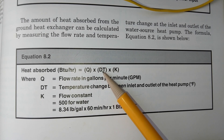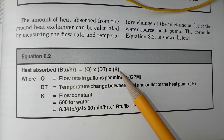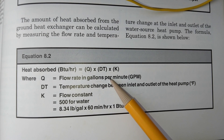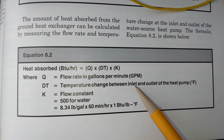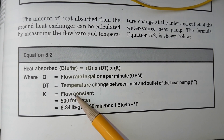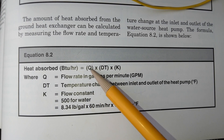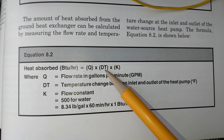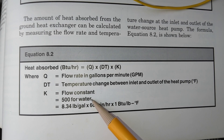This formula will work the same for this rocket boiler stove. So I'll have to calculate the flow rate in gallons per minute that the pump is doing. The difference in temperature I already checked a little bit, and I'll do that some more, and that'll be multiplied by 500 for the flow constant of water — gallons per minute times delta-T times 500.